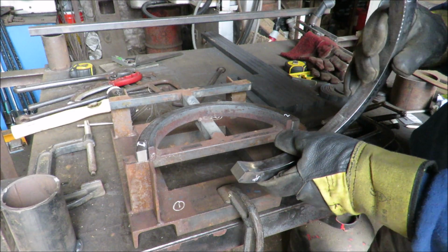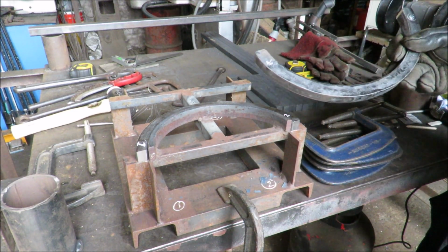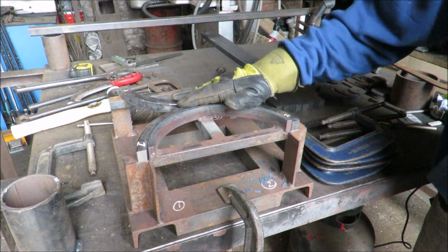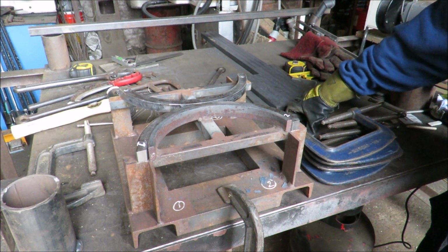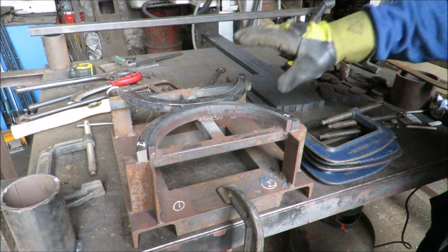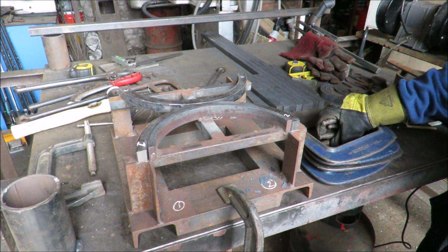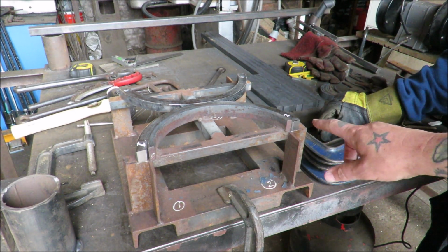Our powder coaters, they're good to me, and I don't want to start giving them mill scaly, dirty, rusty bits of metal. It just makes life easier for them because they can dip this in their acid tank, get it back to raw steel, and it'll powder coat nicely. So we just start now as we mean to go on. Keep sanding, keep it clean. It'll weld nice, it'll powder coat nice. We're trying to get a pro job now, aren't we?